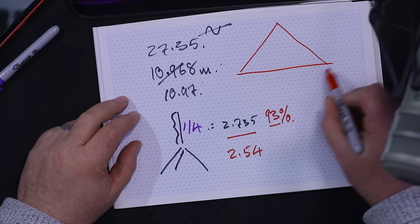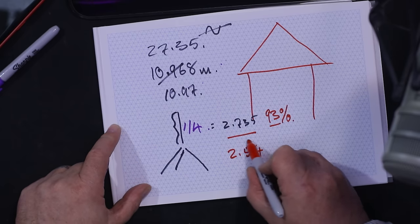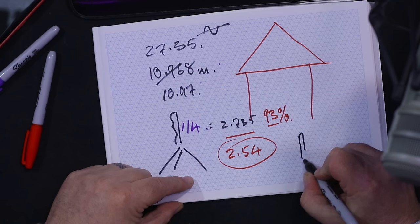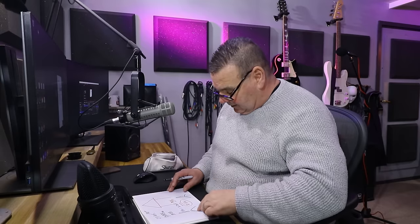I don't know what sort of attic you've got available, but part of my attic is a bit like this — it might be flat or whatever. The problem is 2.54 meters can be a little difficult in a small loft. But there's a really cool solution: you could shorten that 2.54 meters quite a lot by linear loading the top of it — you come up and then come back down again. We've still got the ground plane to deal with, which we'll cover in a moment.